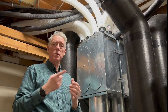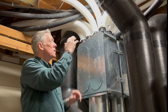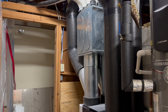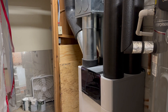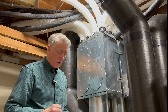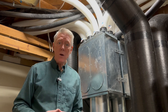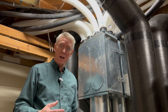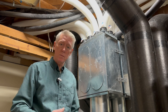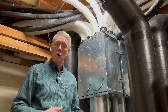The register boxes have either one, two, or three tubes going to them, and they're all labeled up here so you can see these labels. The Comfo tube comes in and goes to the manifold that you see right here. Scrolling down, you can see bigger ducts, and here is the unit itself — this is where the heat and moisture exchange happens, where the fans are, where the brains of the machine are. If you're interested in whole house ventilation, this is one of the best systems in the world — and I would be saying that even if I didn't get this system for free. I love having it in my house, keeping the air clean.